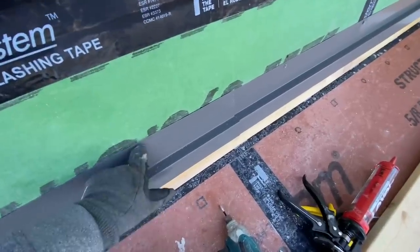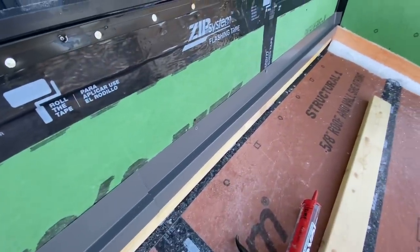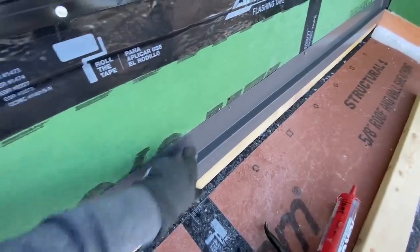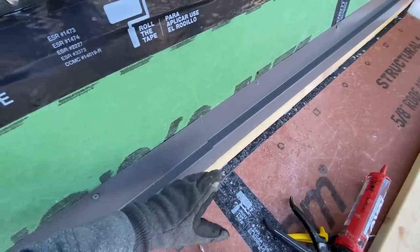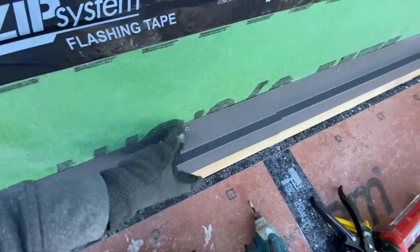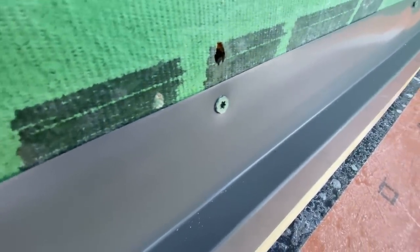Otherwise I would have two hemmed areas folded over each other making a big bulge — like four layers. This is going to be real nice. That's going to be my method for all the butt joints. The reason I'm using screws is so I can take pieces on and off without pulling nails. On this overlap piece I had to loosen the screws to pull the piece away from the wall to cut that bottom edge off and put it back — no big mess bending metal pulling nails. These are really flat-headed screws, actually cement backer board screws.